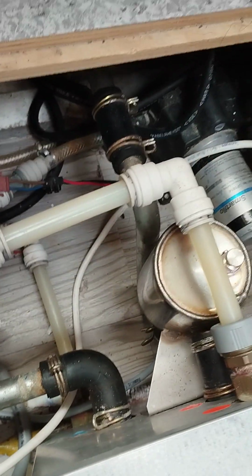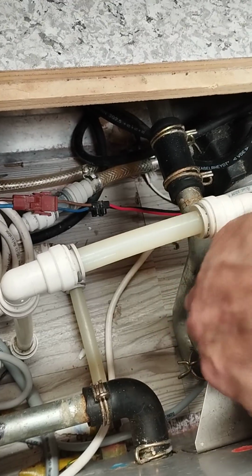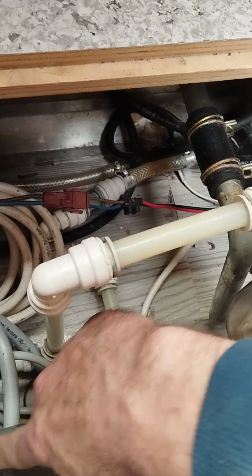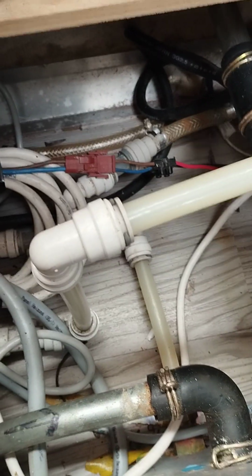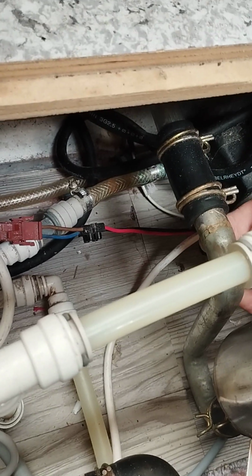What I found is when I was turning on the heating, this canister here would be extremely hot, and the flow of water into the boiler would be hot, maybe 12 or 18 inches back. But going forward, we had no hot water, from the bottom of this canister.